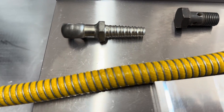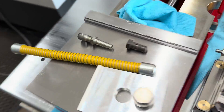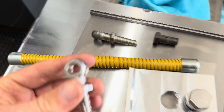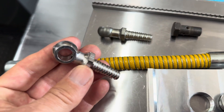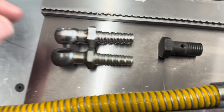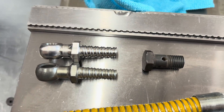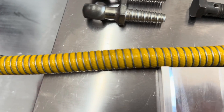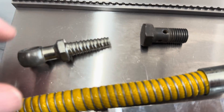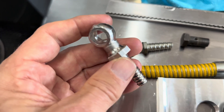This is a huge amount of work to make in the old ways, but not today. With the four-axis CNC, we can start with a piece of stainless steel rod like this, chuck it into the machine, and cut this — a finished fuel line fitting, all one piece. There's nothing to leak. When I put it next to the other one, see how the new one is a little bit larger? We can scale this dimension up by any amount we want. If we want a tighter fit in the hose, we make it a little bit bigger. You couldn't do that in the days before CNC tooling. There's nothing to leak on this — it's cut from a single piece of stainless steel rod.